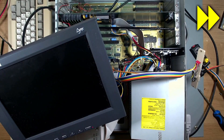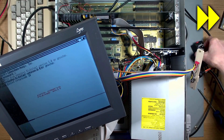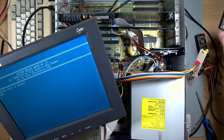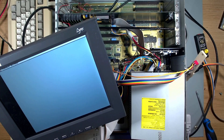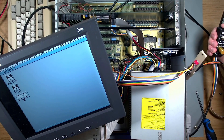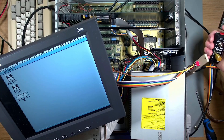I'm going to swap the outer wires on the Action Replay side of the switch and retry this. I'll do this off camera rather than moving the Amiga completely off my bench and setting it all back up again. So the next thing you're going to see is me testing this again. Retrying and with the Kickstart 1.3 setting the Action Replay is working properly. Power cycling and flipping the switch, and eventually we get into Workbench and the Action Replay is disabled. Perfect.